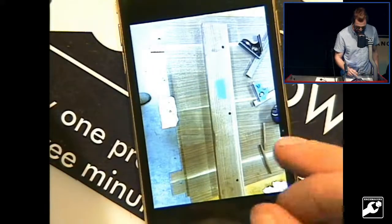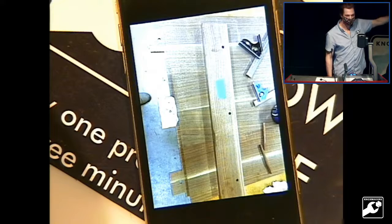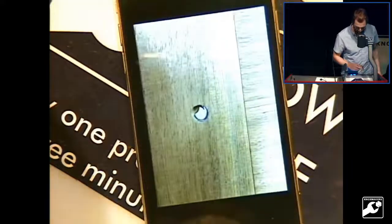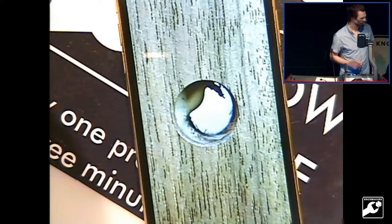So there they are drilled. This is showing how I actually glue it up. You only glue just that little 4 inches in the middle, because the rest has to be free floating, otherwise it'll break itself. And if you look in here, you can see how those holes are slightly mismatched.